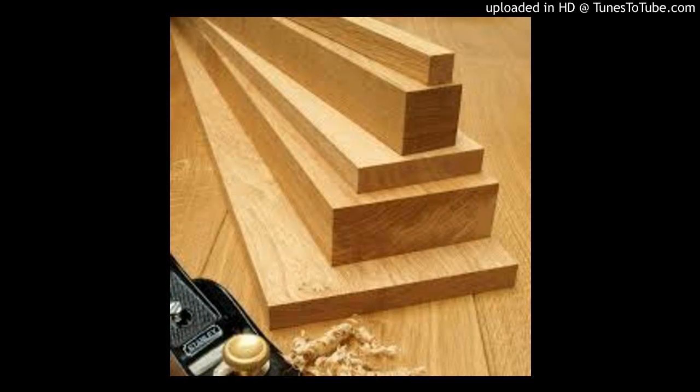So we recommend, and this involves using set length decking. So we'll start looking around about what modules we will use. And here this is, what, a 3 metre and a 1.2, and 1.2 is a little bit short. And here we've got 3 3s and a 2.4. Good lengths, and a spread of lengths is ideal because it gives the sawmiller the opportunity to use his fall down. So cut for the 3 3s, and any with a bad end go in for the short length.